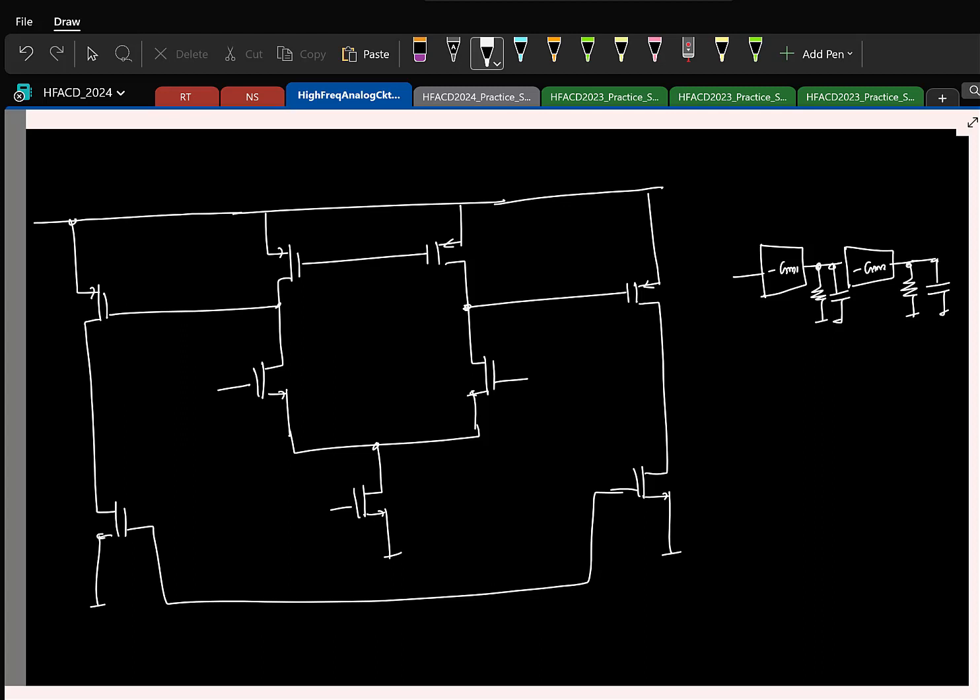So now we want to compensate. How do we do feed-forward? We add a faster path. How do we add a faster path? From the input to the output you add another gm. What should be the sign of the gm — plus or minus? The way I have drawn it here, remember that both should have the same sign, because you want an LHP zero. So this should be plus gm3. I am drawing this because you will be designing it in a second design project.